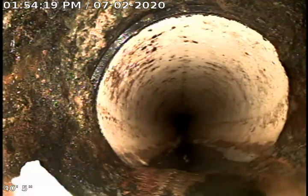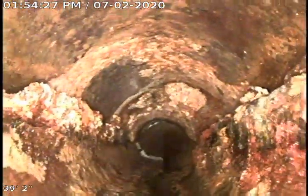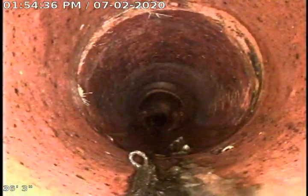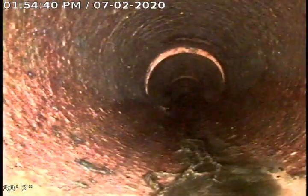I've marked this spot. This is at the foundation — it's about seven and a half feet deep. You'll notice that the cast iron is broke on top, coming through to the clay there. Right there is the transition to the clay. As we pull back, there are a few roots at the hubs. I recommend having that cabled as well to clean these out.